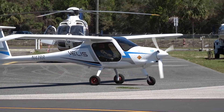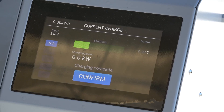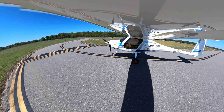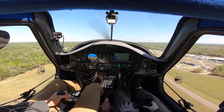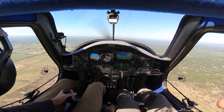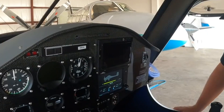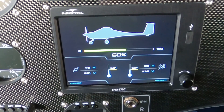It's worth covering SOC and SOH. State of charge is fairly simple and can be thought of as an electric equivalent of a fuel gauge. You'll ideally start at 100%, but if it reads 50% or less, go directly to the charging point before flying, and once airborne, plan to land with at least 30% SOC. State of health is not quite so straightforward. If we stick to the fuel analogy, it sort of represents the fuel tank capacity — but while a fuel tank remains the same size throughout its life, a battery's capacity will gradually diminish. So if you depart with 100% SOC but your SOH is only 40%, you will have considerably less range or endurance. Your fuel tank effectively gets smaller over time, so range and endurance planning requires knowledge of both figures.